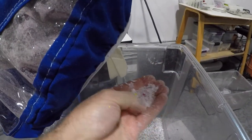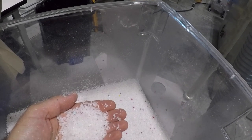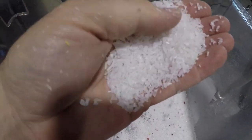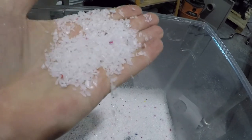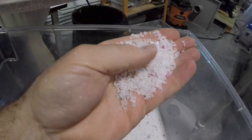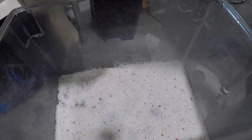Here's your processed material — we used the six millimeter screen for your material. We're through the test and it took less than a minute. Some labels were still on, but here's your material — it's not bad, there's no heat and not a lot of dust. Your material is kind of thin so you can always go with a slightly larger or smaller screen. The machine processed it without any real problems at all. We got through all eight containers in less than a minute.